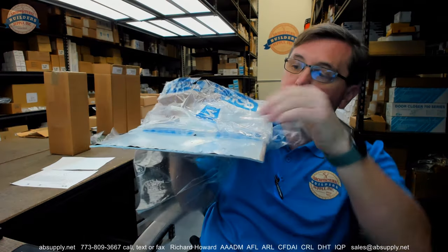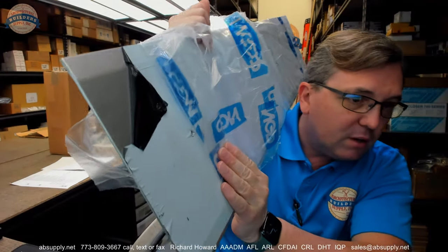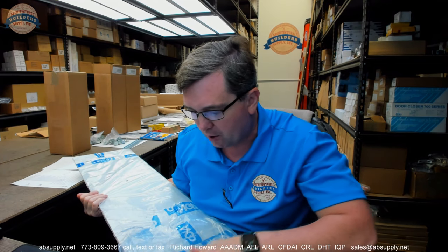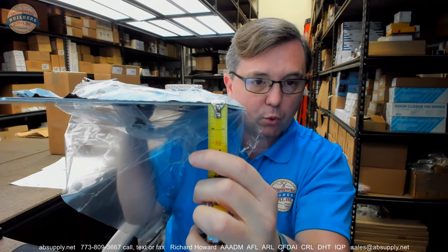This has a peel-away protective film that is protecting the mill finish. That is definitely what mill stainless looks like — a very clean sort of surface, although it is mill and it is not going to be without any surface visual marks. It is simply a mill finish, and the term mill means what it looks like when it leaves the mill — when this plate is created, there is no work or treatment done to the surface. Ten inch overall wide, this is going to be a quarter inch tall. Quarter inch overall height — material thickness is definitely not insignificant, that is for sure.